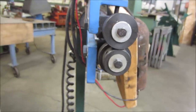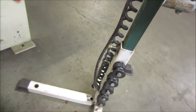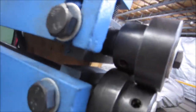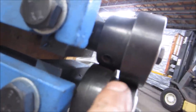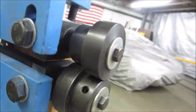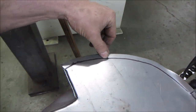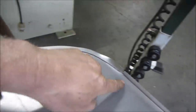I have these two. I'm going to try using it like a tipping die. There are three different sets of setup, and this is the one with the most stagger to it. I've left some space in between. I'm hoping I can bring the piece in and let it bend up on an angle. As long as I can get a little bit of a bend on it and a crease, then I can kind of hammer off of that and hold that line. It is a guess on my part, but that's my plan. So if I can roll that and create a line of sorts.